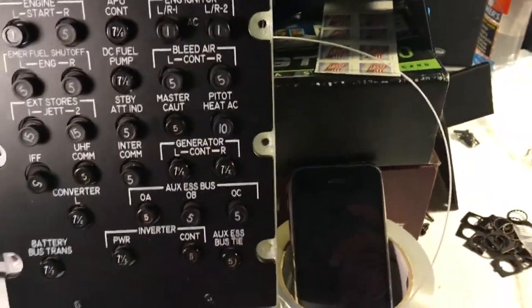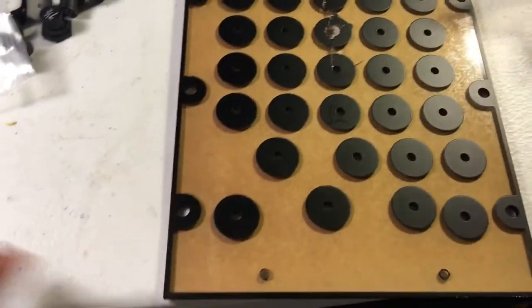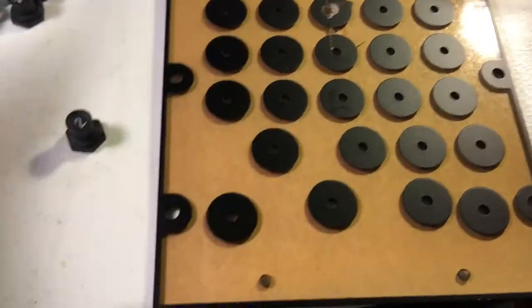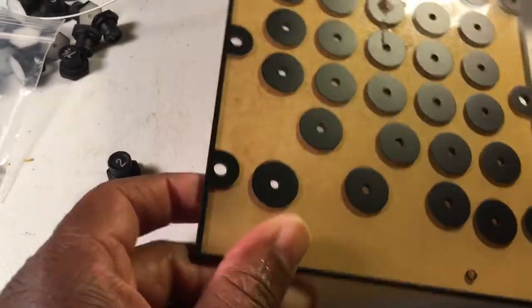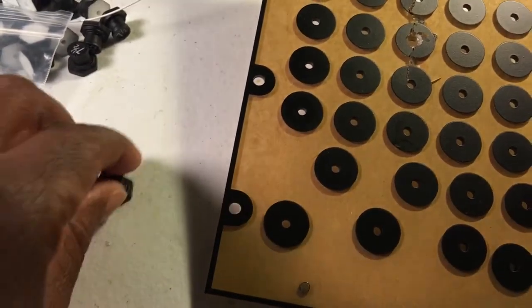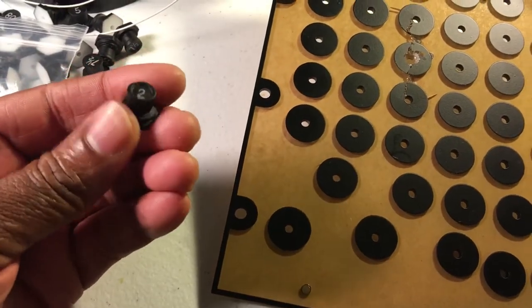Now, the panel that comes with your circuit breaker panel is actually this guy here, and the holes are fairly small, but they are the right size for this screw pan head. So the screw head is on the opposite side, and this acts like a nut, so to speak. These are actually threaded so that as you tighten your screw, the compression pulls this guy down tight. So then when that happens, he doesn't move.